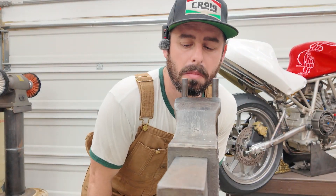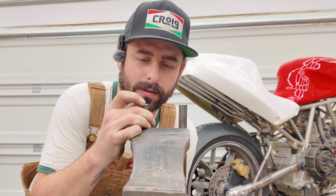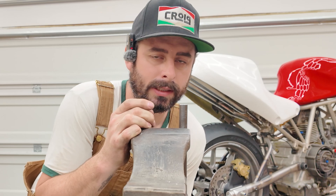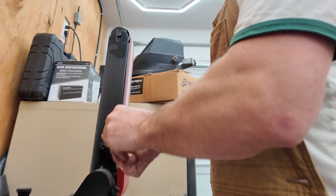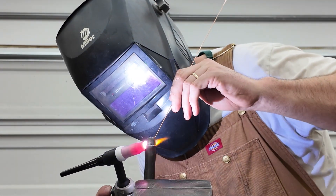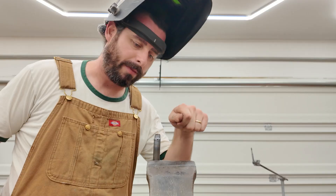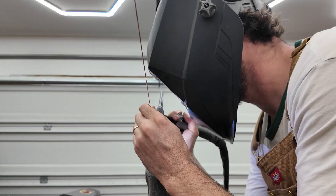I've been trying to figure out the right but also fastest and easiest way to put these little nubs on. Normally you would form those out of steel and weld them on, grind them down, but I think I might just build it up with weld. Upon further review, I realized that an acorn nut is actually pretty much the same shape, except it's covered in zinc and you got to take all that stuff off before you weld anything, which I did. Upon tapping it down I dented the top, realizing the top is very thin. So I'm going to buzz it off and then build up some weld on the tip so I can get this a little bit more conical to match the one that's already on the frame.